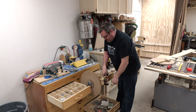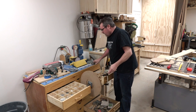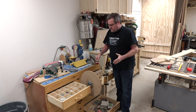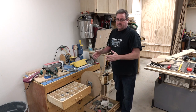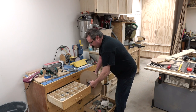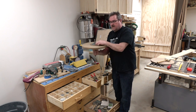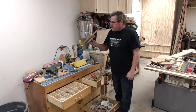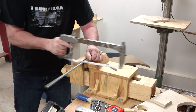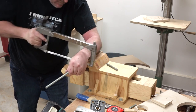I also set up a stick here with a pencil sticking out of the end of it so it'll make a mark on the wheel, but I'm not going to do anything with that now. Like I say, it's close — there is some wobble there but I can work with it after. What I need to do now is actually bolt these things on, and I'm going to do that with pieces of 3/8" threaded rod, cut to length, then drill the holes through the wheels and put the threaded rod in.